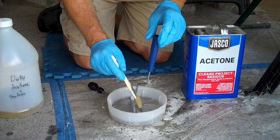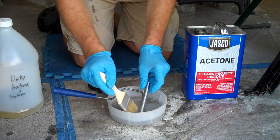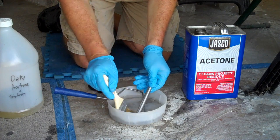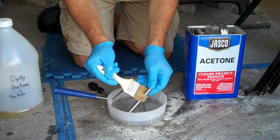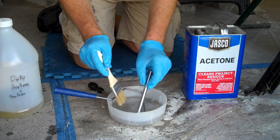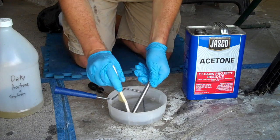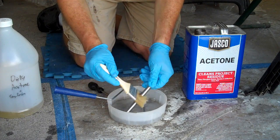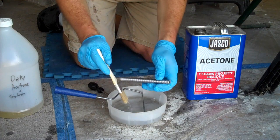I do recommend disassembling it entirely every time you use it. And if you use it for a long time, you might start having the earliest batches of epoxy starting to set up on it. I'm using Slow Cure Hardener, so it gives me a lot of extra time. But if you're doing fast epoxy, you might want a second person just to clean your tools, mix epoxy, and maybe swap out tools halfway through so they can start cleaning the first set.